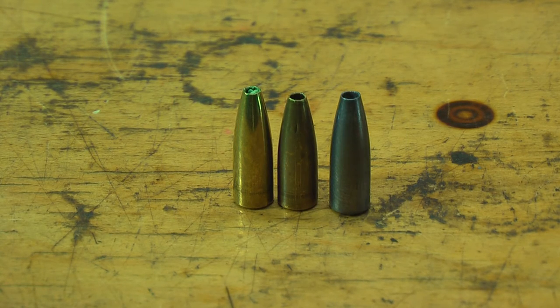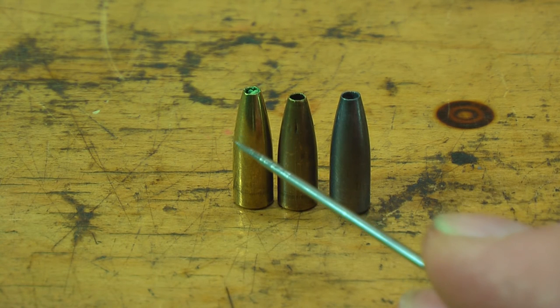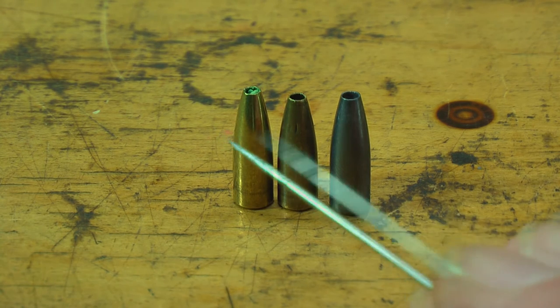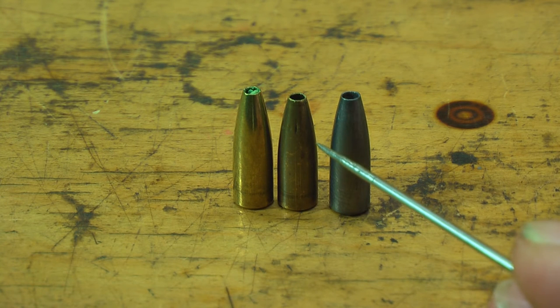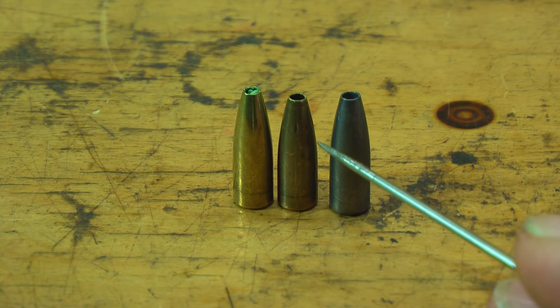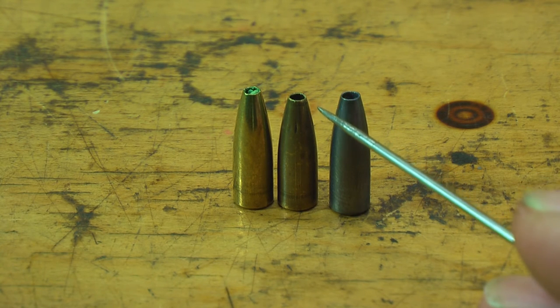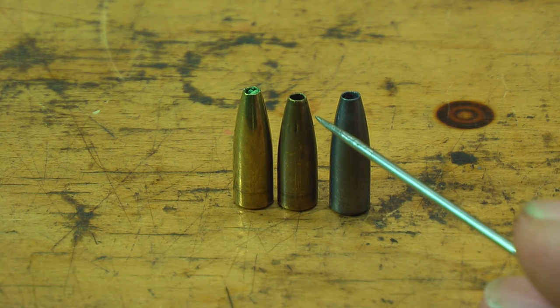What you're looking at here is the 60-grain hollow point and the 55-grain hollow point as the jacket turns out just from the forming. But right here is another 55-grain bullet that's slightly shorter — I turned the jacket down to 0.700 inches to make the bullet a little more length-tolerant, so I don't have a giant empty cavity with no lead support in the jacket. This also makes for a much more consistent overall length when seating them.